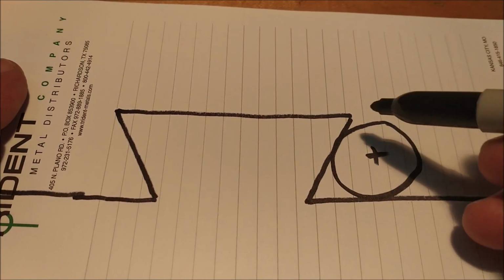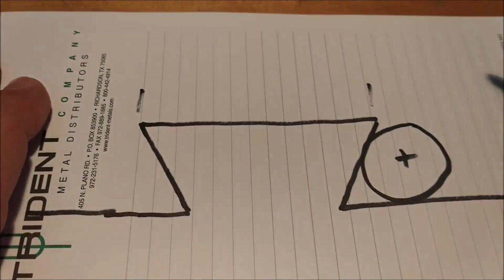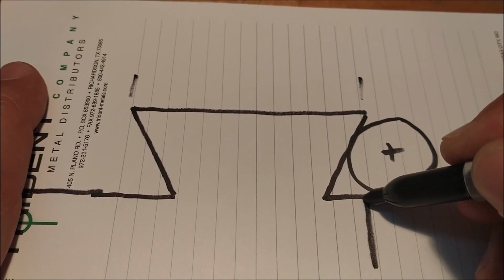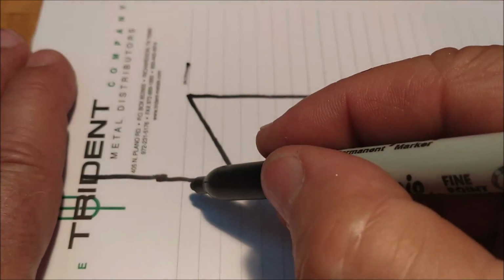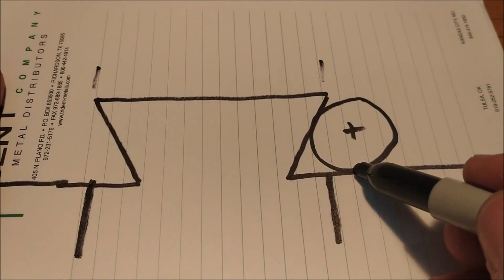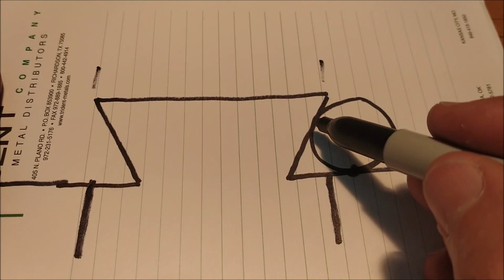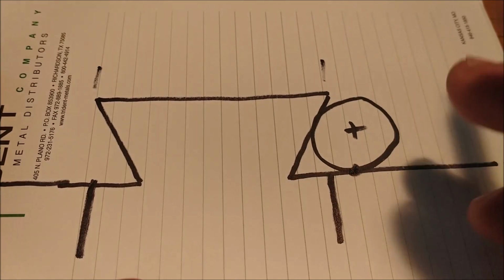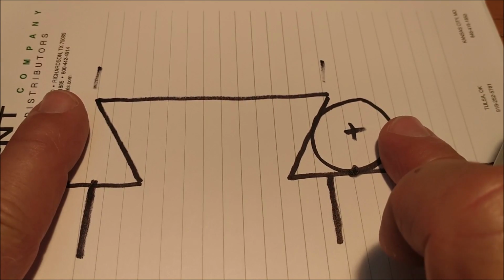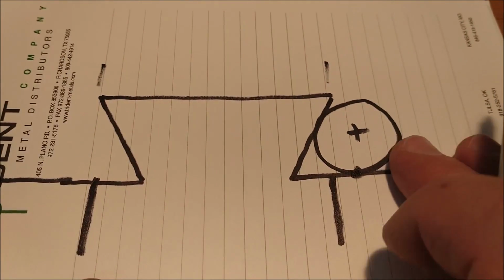Well, in this particular situation, with the dovetail being called out as 500 across the points, and the part itself is only 500 wide. Okay, here comes the hush over the crowd, right? I think you can see where I'm going with this. There is no tangent area out here for this pin to sit. So if this pin were to go tangent to this surface and roll into this point, the pins would be closer than what you're looking for, and it would give you an incorrect reading.